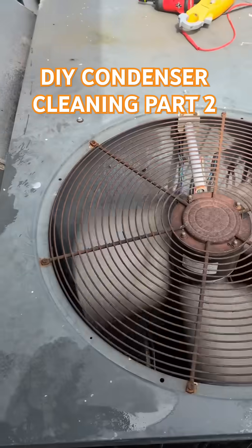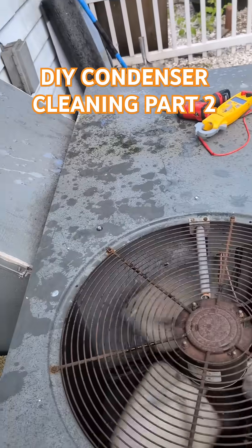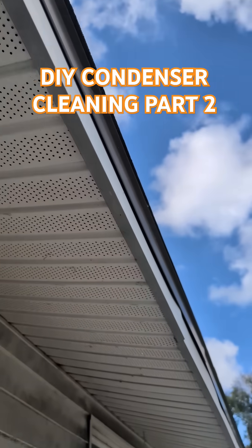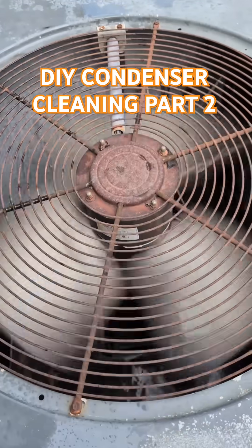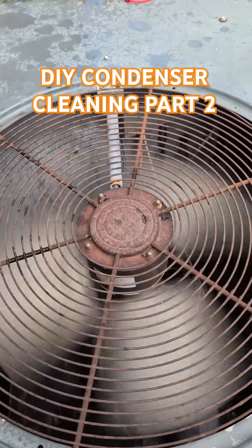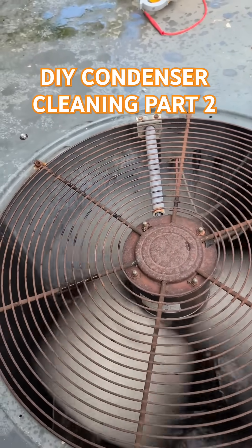Don't be so dramatic. This is what's in your coil that plugs it up, basically. Also, there's no gutters on this house. Water rolls right off this roof when it does eventually rain in Florida and goes right down into this fan motor. They're designed to be in the water — they do that for a reason. They've got drain plugs in them.